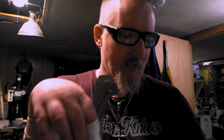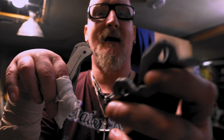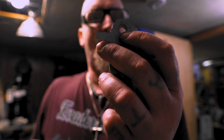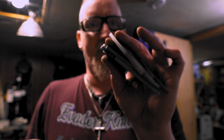What I'm gonna do now though, is go back with all these blades. I nicked my finger. I don't want blood all over the place. So, I'm gonna go back and hit these bearing races just a little bit since now the mill's all straightened out. Because I can always surface grind these blades in this titanium if I go too far. But I want them all straight and see if that actually fixes the problem. So, alright, but I'm going to go set the cameras up and that'll be in the next video.